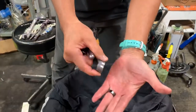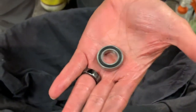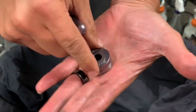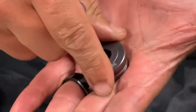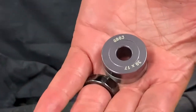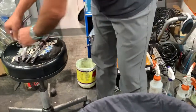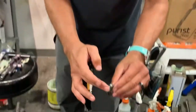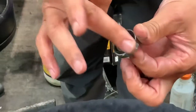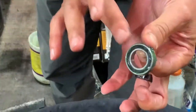This is the new bearing. We're going to use this new bearing and this fitting so it doesn't damage the bearing. It fits perfectly there, and it is 30 by 17. So there's the bearing in its carrier. I know that you folks who have been watching my channel for a while know that I grease everything — so we'll put a little bit of grease on here to ensure ease of installation.